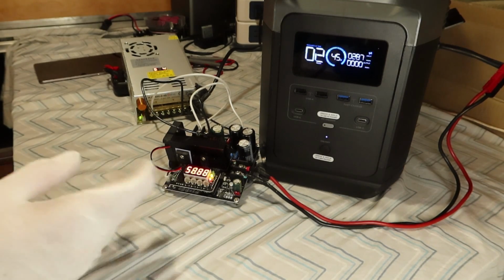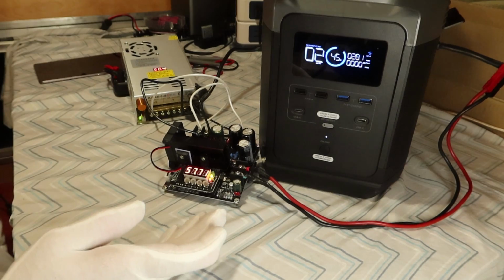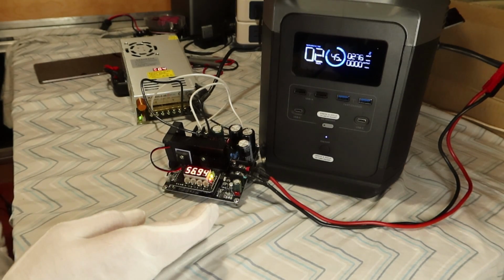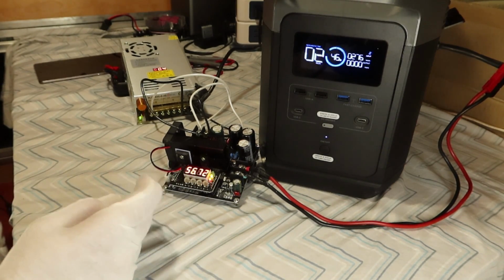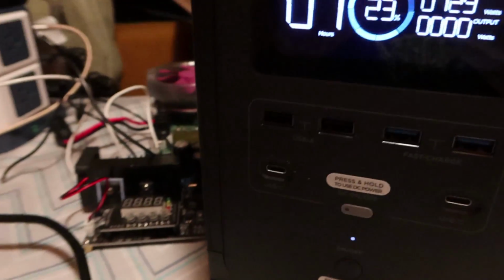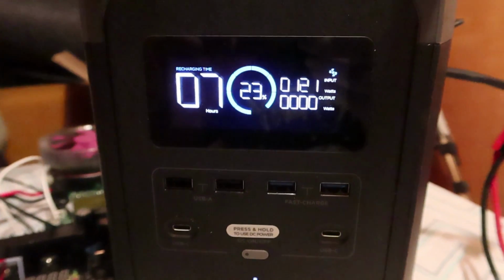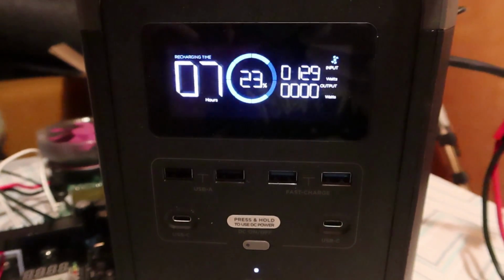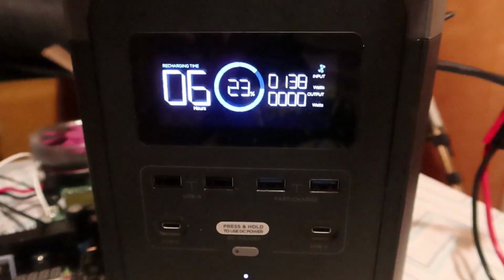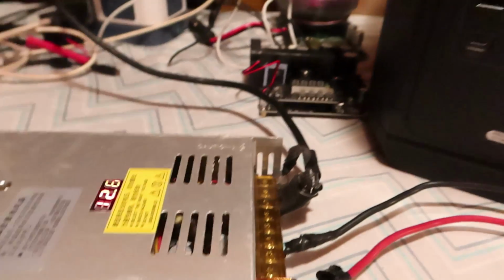So this is one of the smartest charging systems I've seen so far. It's an MPPT controller. It allows a crazy amount of voltage, and it will just self-limit on the amount of watts coming in. And at 12.6 volts, it looks like we're getting mid 130s, upper 120s on average, which makes about sense. See, there is a 10 amp limit on the input. So you can technically charge this from a lead acid battery.